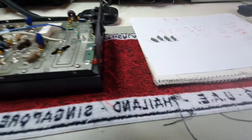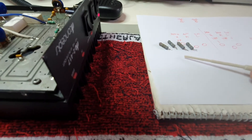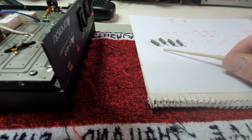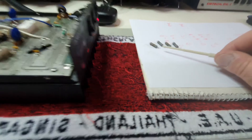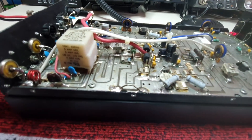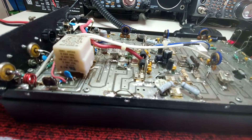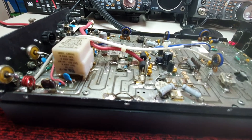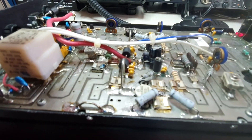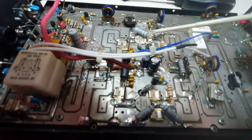So what have we been doing this week? We replaced what were meant to be four 39-ohm 3-watt resistors. Several of them — this one and this one on one side — were reading quite different values: one was down to 37 ohms and one was mid-39s, nearly 40 ohms. We replaced those and the heat dissipation changed; we found it evened out.